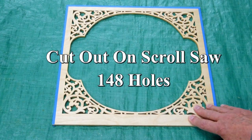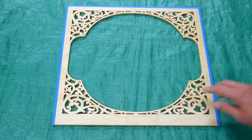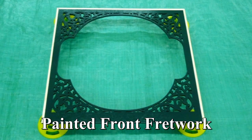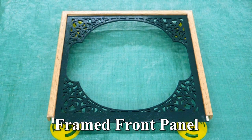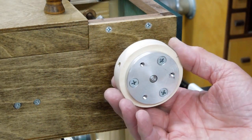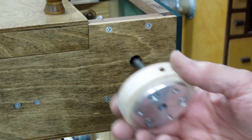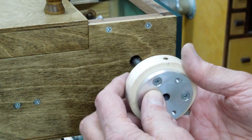I've sanded this on both sides and applied one coat of lacquer sanding sealer. This will be sanded again and then I'll apply the spray paint. This has been taped off to leave a clean edge so I can glue the trim strips on the front. This is my hand wheel adapter — one inch in diameter, with two set screws that tighten onto the shaft. This piece of wood is five-eighths of an inch thick and will eventually have a groove machined into it for the belt drive, then the hand wheel screws onto this.